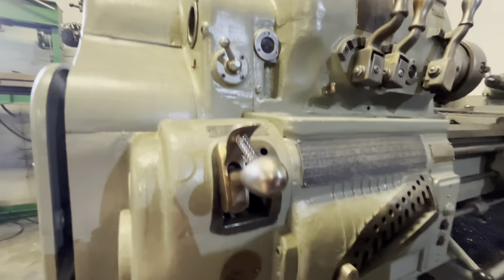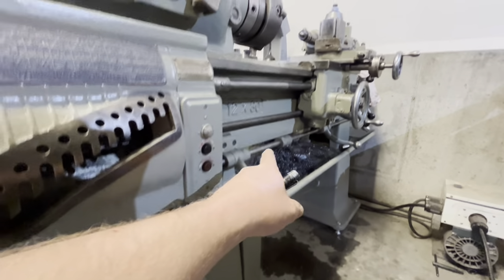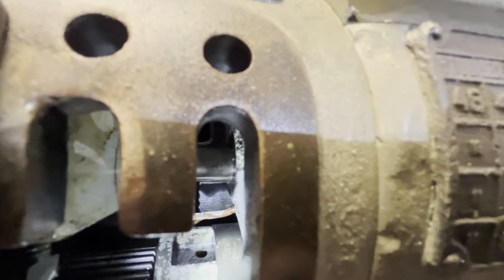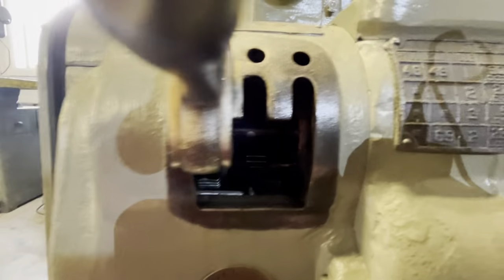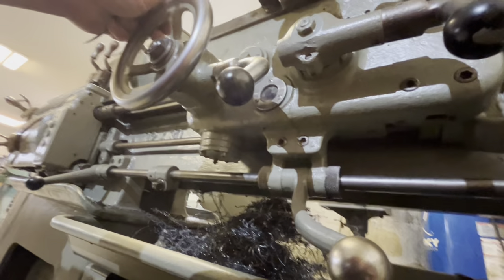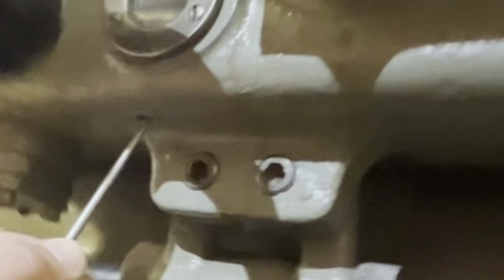You can see if this pump is working by engaging the lead screw drive assembly and running the machine, making sure the lead screw is turning. You should see that little copper tube dripping oil into that little gallery with a hole in it fairly consistently — that ensures the pump mounted up under here is functioning.